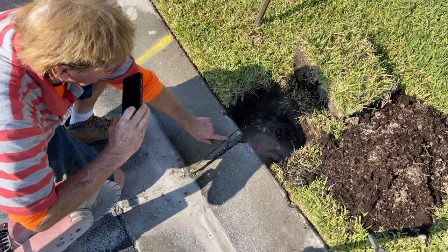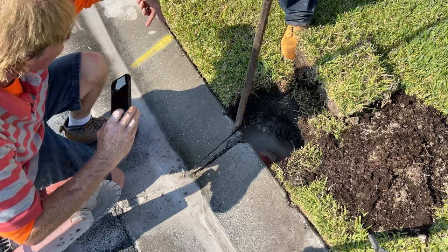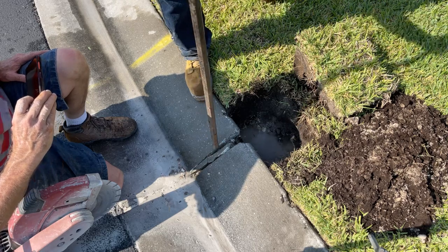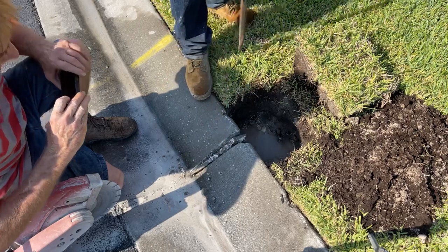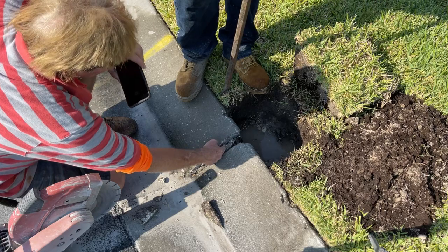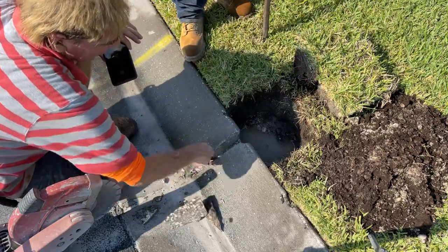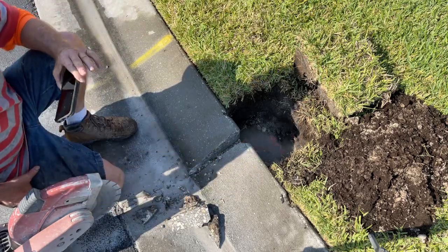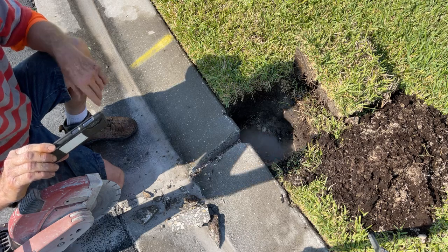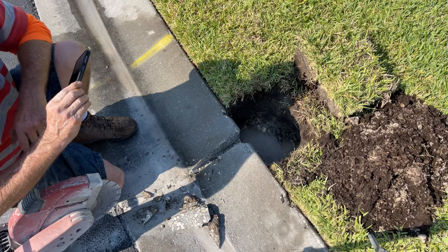On this cut, because he chiseled it, I went a little bit wider. But I'll bet it pops right out. Let's hit it hard one time — there we go. Looks like we need to clean that out a little bit. There it goes — perfect. A little deep, but it'll still work good. And that's the basics of making a V-cut in the half-round curb. Nobody else does that — these other companies don't even core the curb, let alone try to do something in the half-V. This is a half-round curb, and we figured that out about 25 years ago up in Charlotte.